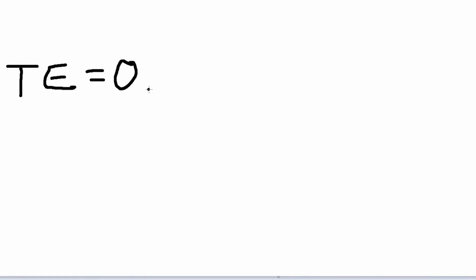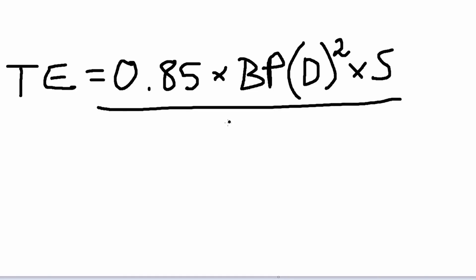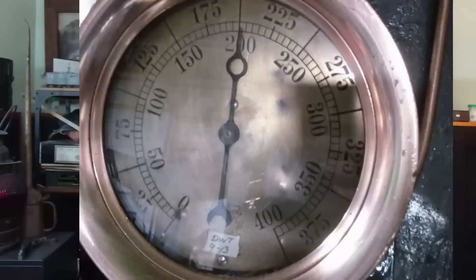A lot of these myths are going to become really obvious and easy to understand when you understand the equation. Tractive effort for a very typical two-cylinder simple locomotive — no compounding, your bread and butter — is calculated as 0.85 times the boiler pressure (maximum allowable working pressure), times the diameter of the pistons squared, times the stroke of the piston, all divided by the driver diameter. So if you know how big your pistons are, how far they move, how big your wheels are, and what pressure the locomotive operates at, you can answer everything you need about the tractive effort. There's also a handy calculator on steamlocomotive.com — links in the description.